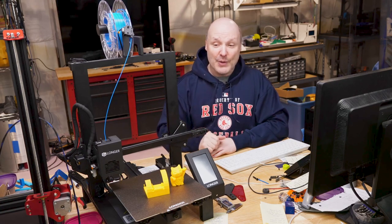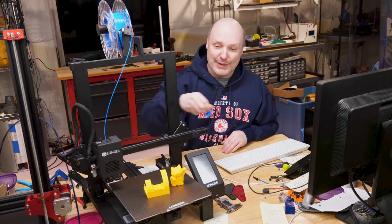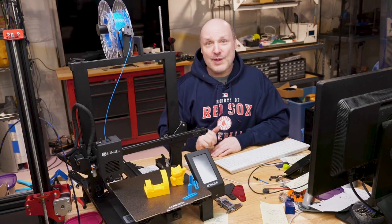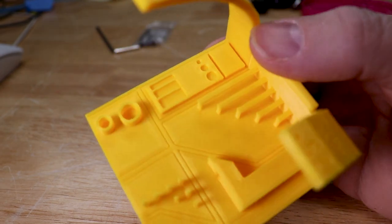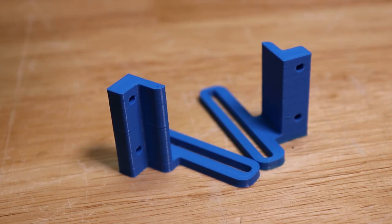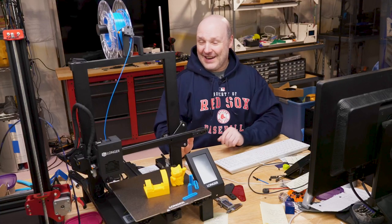I did a flow cube and got these prints. Essentially, the whole reason for all of this was that every print was a disaster because this thing was bouncing all over the place. I just started one G-code, then the next one, then the next one. I've done a bunch of additional prints in blue — you can see the blue filament — spacers I need for another build. A close-up of these, you're going to see that the 3D print test came out absolutely great. This printer is capable of doing some excellent prints. I went through, made some changes in my slicer, did the little 3D-printed Lucky Cat — that looks great. The blue pieces as well look fantastic. The long and short of it is, if you're willing to put in the time, effort, and frustration, you can yield some good results.